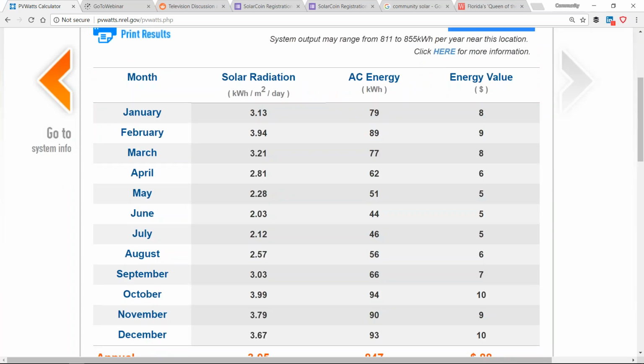And so actually, if you're doing, say, an off-grid design, and you're all electric, you may be just as concerned about having that electricity in the wintertime as you would in the summertime, because you need heat. And so putting that solar module at 90 degrees down the side of the building, even though it's less productive, it's not going to have snow on it. And so if I'm building a cabin that's off grid in northern Vermont, maybe even building the walls of the cabin out of solar panels is not a terrible idea.